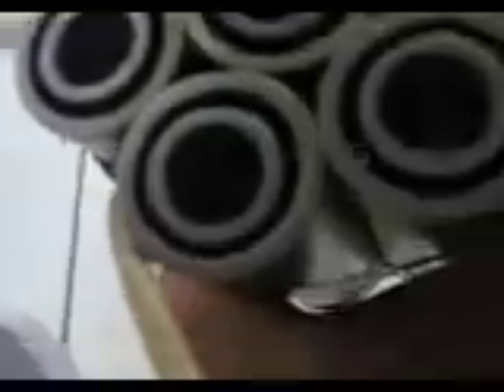They also do not put any pressure on the 1-inch pipes, so you can see the spacing between the pipes is identical — it's about 1/8-inch. So that doesn't squeeze them. If I was to use one of the hose clamps around that, it would squeeze them together and pop some of the rubber inserts out. And that's what I have inside to separate them — tiny little pieces of rubber hose on the top and on the bottom.